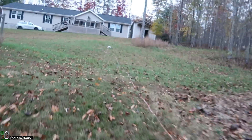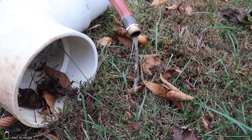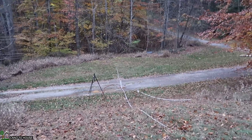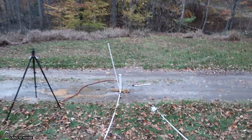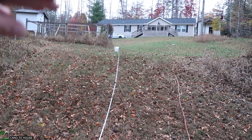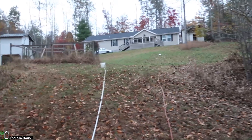Check it out — we managed to reduce the input head pressure by keeping the initial head pressure and pump location the same. I think we're getting some shake on this tall standpipe, or we're still not high enough. If you look at head height here, from this point straight across level there's still at least three feet of input head pressure. Probably another one to two feet on the standpipe would get us there.